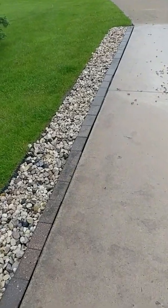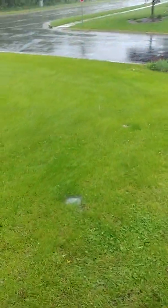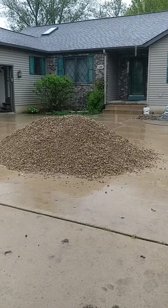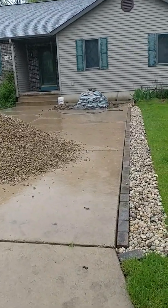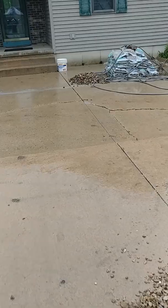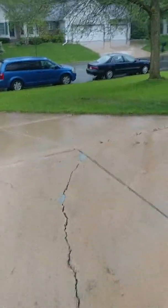Just regular old slotted pipe — NDS probably — comes out over here into the pop-up. I dug all that by hand. Most of them I did with the trencher. I've used about ten tons of drainage rock. I should have bought washed rock — I didn't know the clear gravel had some limestone in it. I still have about a ton of river pebbles left, inch-and-a-half. I'm kind of detailed — I even wash my old rock.